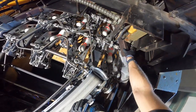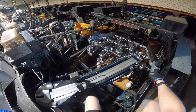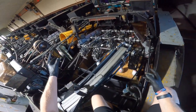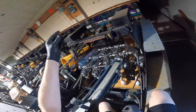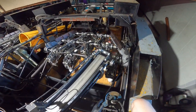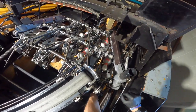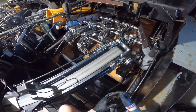It's the same deal on the front: once you adjust the rods in the back, you're also going to want to make sure the level of the front of the table is good too, because depending on what you do with the rear rods that may increase or decrease the distance of the table from the pin deck — and that's important because you'll get pins hanging up in the respot cells. It's not as complicated as it looks; you just have to get in there and learn how the rods work. As you saw in this video, over on lane four we adjusted the rod that controls how high and how low the cups sit.